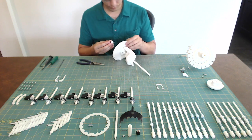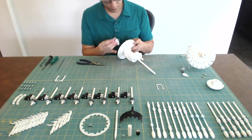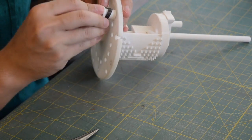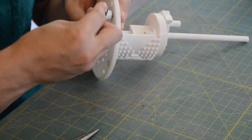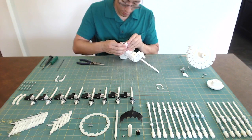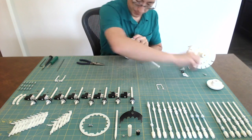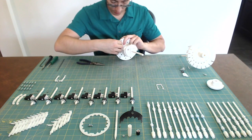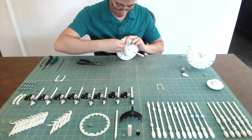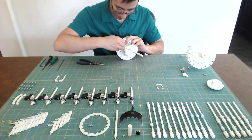There are 2 pairs of larger and smaller holes on the bearing plate. The zero positioning lever goes into the larger hole without threads. Insert the zero positioning lever to the base plate and fasten loosely enough that the lever moves easily. Use some thread lock if necessary. When adding the zero positioning lever, ensure the other leg of its spring inserts into the small hole in the base plate.